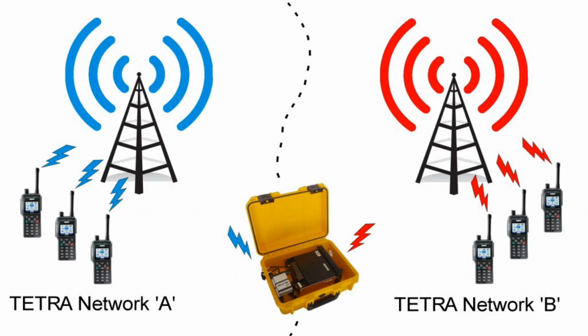That's a long list. And for safety, these are meant for restricted access locations. Only trained people should be working on them. And this is really key. The manual insists all antenna cables must be grounded right where they enter the building. Yeah. No exceptions. Grounding again. Okay. What about environmental stuff? You mentioned sun shields. Right. If it's at a corrosive place, like near the coast with salt spray, needs proper air filters, extreme cold or heat.